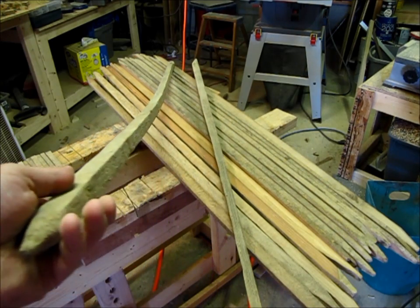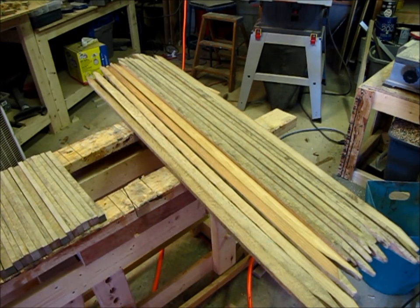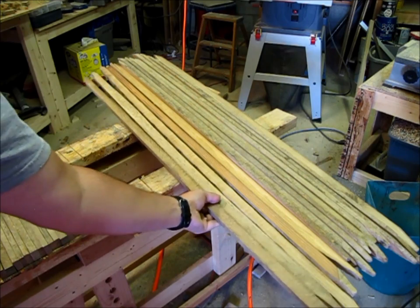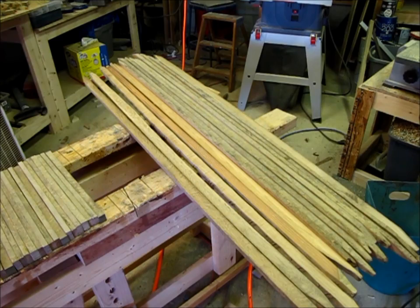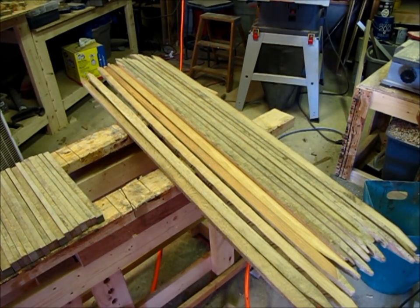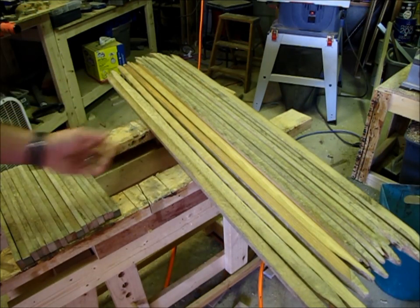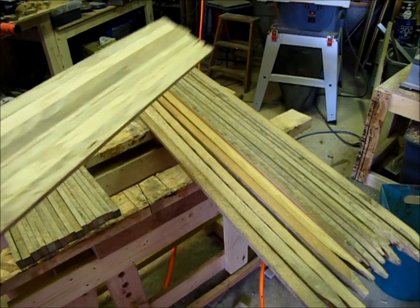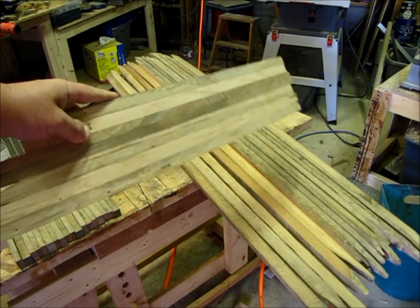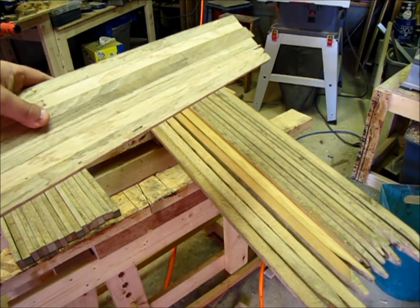They don't always come out straight. What I do is I pick the straightest of them — you can see a very large stack here. I've taken just a 13-inch planer, or some type of planer, to make two of the sides flat and nice and smooth. Then I glue them up into basically a board. It will be very uneven. Then I take the board on the other side and you can see this is one that has been planed a second time — it actually makes just a really thin board.